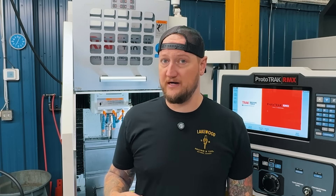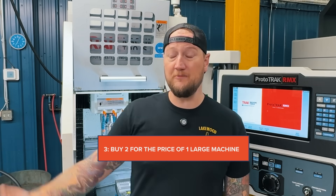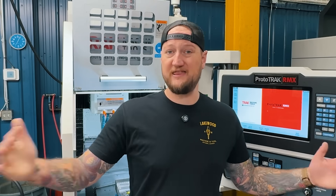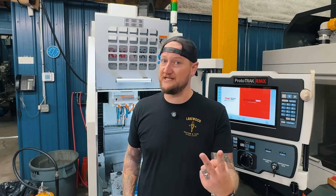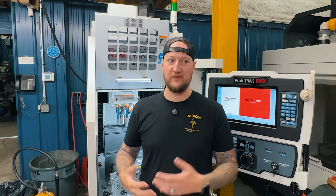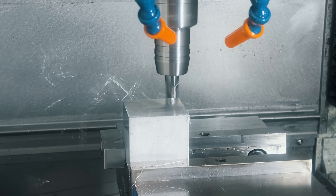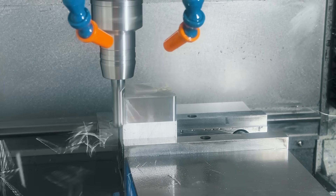The other thing you should consider is that for the price of a bigger mill that may have a 60-inch table, you may be able to get two of these for the same price — depending on where you are and your distributor. You may be able to get two of these and fit them in a smaller footprint than that big machine. Now you've got two spindles instead of one. It's really going to depend on your capabilities — if you only have small machines, maybe you don't want another small one. But my advice is save your big machines for the big work, and consider smaller machines for stuff that just doesn't need a 60-inch table.